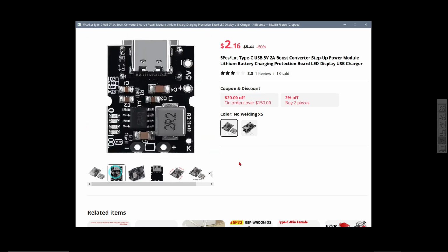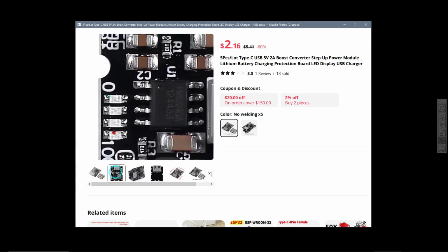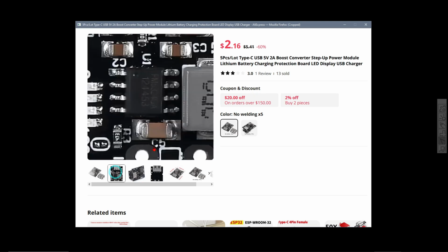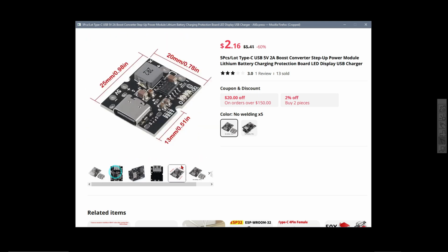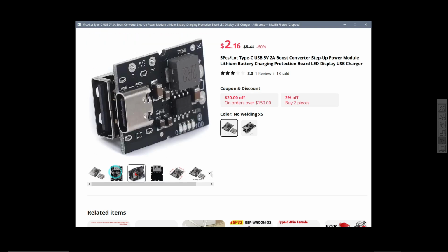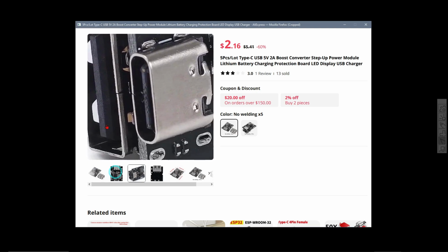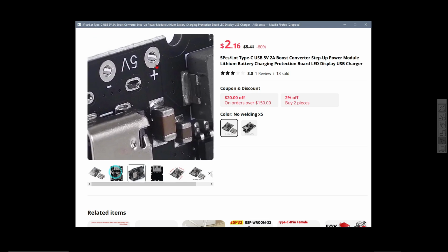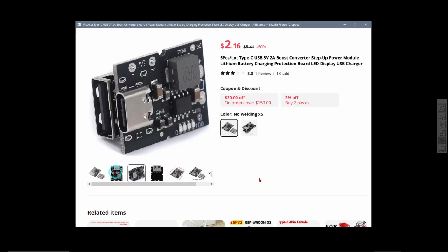So what actually happens with these guys is that the charging works very well, and shows you 25, 50, 75, 100% charge, little LEDs on there and stuff like that. But the output voltage, on this particular one, it's got that optional socket there that you can mount, or you can just get the voltage from those two pins over there, is that if it draws less than, I think it's like 50 milliamps or something like that, it just shuts itself off.